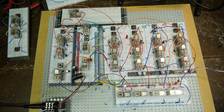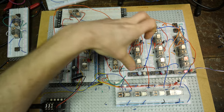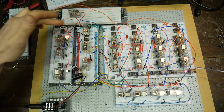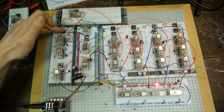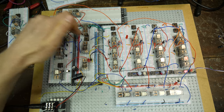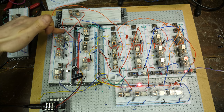So you need to make another circuit, and that's the circuit over here, which actually writes a bit into the sequence, but only ever writes one bit. So if I flick this, now there is a bit of information in this relay circuit over here, waiting to be sent into the sequence. So I'm going to push the sequence, and now it's sent that one in. And if I push this button any time, I can add an extra step. But I'll only ever be able to add one step. So if I push my finger down, it's only added one step in there.